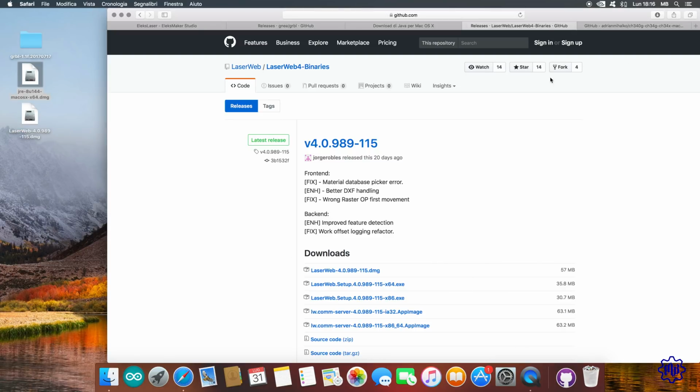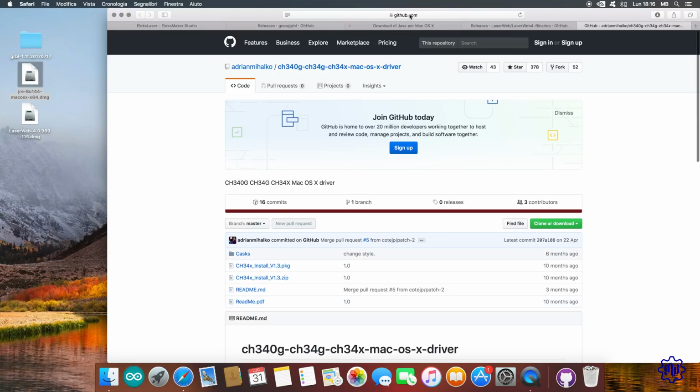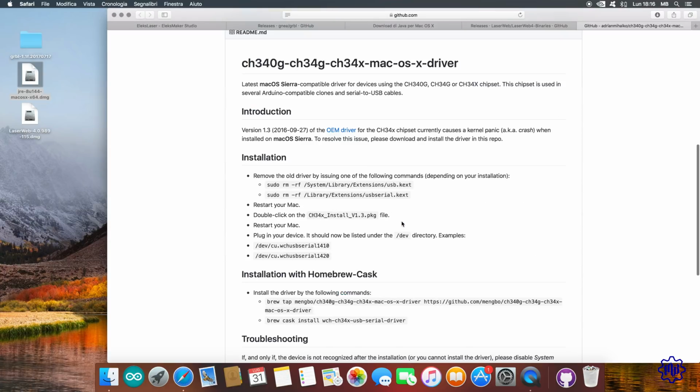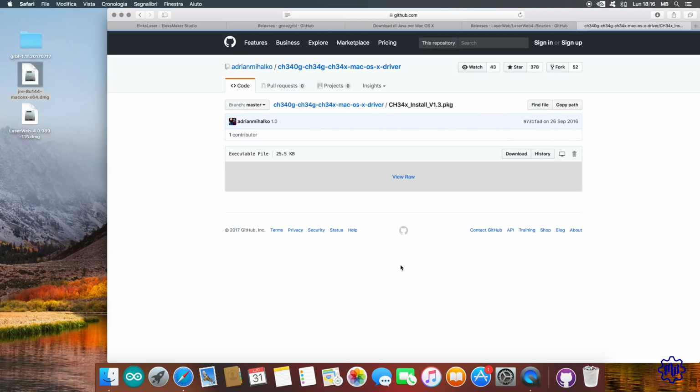At this point, if you are using Windows 10, you may have finished downloading, but if you have any older version of Windows, or you are using OS X Sierra, you will definitely need a driver for Arduino clones. Eleksmaker, in fact, uses a Chinese Arduino Nano clone, which is not recognized by the PC. This link is for the Mac version. In the description I will leave the link to download also for Windows. We download the .pkg file, and we do all the installation steps.